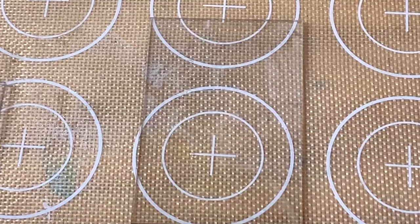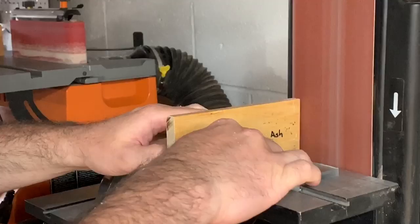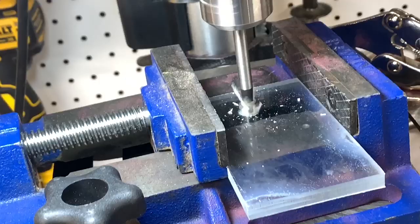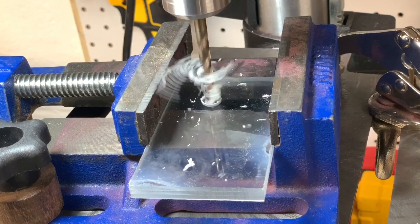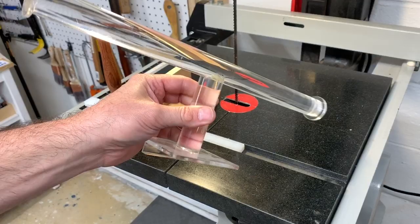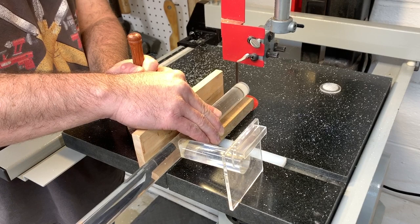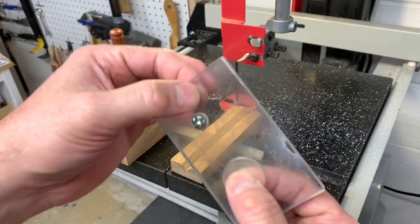To get the right thickness I ended up using three layers of 3/32-inch thick plexiglass. For the locking mechanism I used a machine screw and a bolt, which also centered the mechanism on the plexiglass. For adjacent wood strips I used an oak strip and a poplar strip — the poplar is sized for a ruler to be added later, and the oak is a bit wider for more support. I found an acrylic jewelry stand that was exactly the right diameter for the hole I drilled, and I just cut off some slices of that.